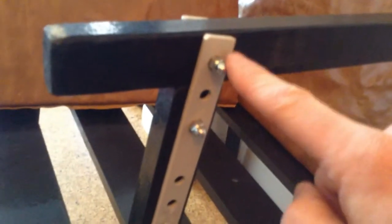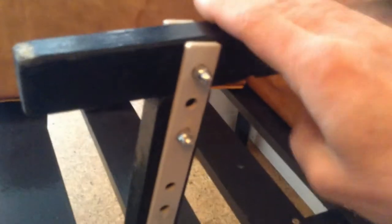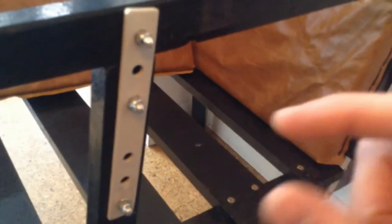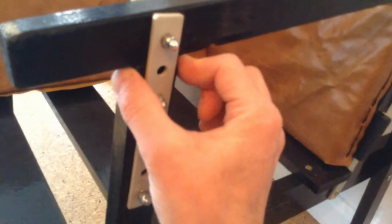And so I can't have all of the joints, bits of wood, oversailing past one another to bolt through just to avoid fixing at the end. So what do I do when I get the end grain of a bit of wood and it's got to abut the middle of another bit of wood? Well, I've gone for these straps because that's the most dumb, the most moronic possible metal fixing that I can use. A bracket has an angle, or I looked at P-clips, I looked at threaded bar, all sorts of other things, but you can't get any simpler than a rectangle with some holes drilled in it. And so that's these straps, that is the basic thing I've done to hold the chair together so that I can make fixings at the end grain of a bit of wood.